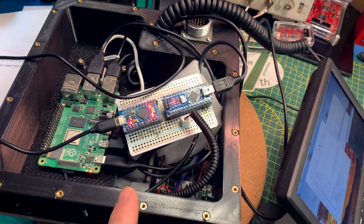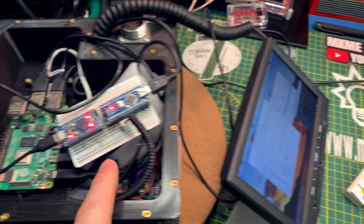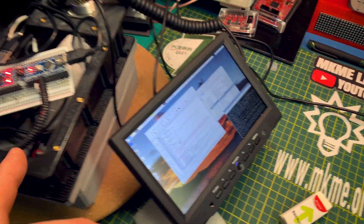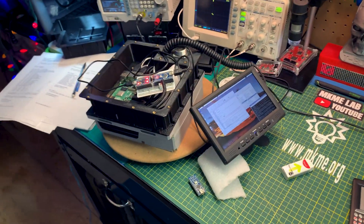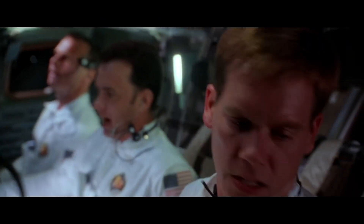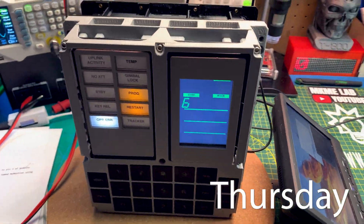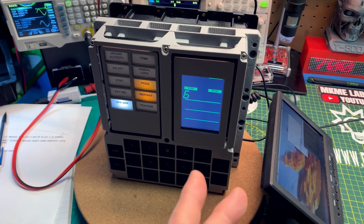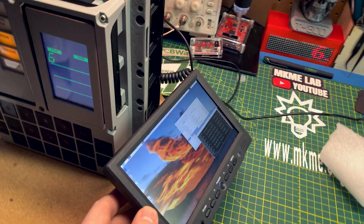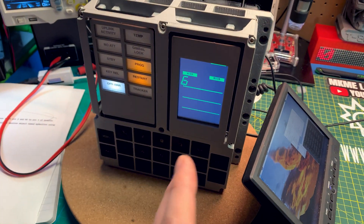I'm rebuilding the Virtual AGC software now — wondering whether it got corrupted somehow when I was messing around. Pretty sure it's software now. It can't connect on the localhost IP. I'm not a Linux expert so I don't know what would cause it to get hung up. I changed the ports and no dice. After rebuilding the software we are alive! The wires were swapped — I did it in hardware to fix it and swapped back — and the Nano was just fine. It was the software that couldn't connect to localhost for whatever reason.